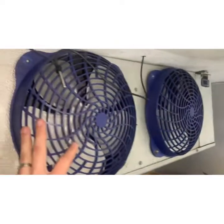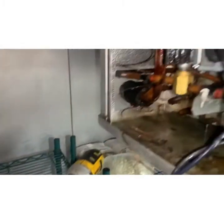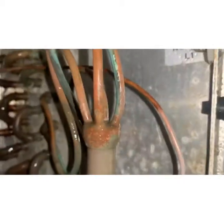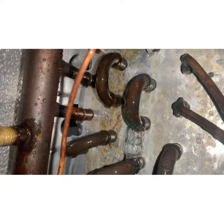Welcome back to the leaking cooler. So, spoiler alert. I took my leak detector and it was just going crazy in there. I couldn't pinpoint where it was. So, we've got the leak detector. And what you do is you spray it real stream like that. You don't want to create a spray, because if you spray it makes bubbles just when it makes contact. But as we kind of coat everything, look at there, and it lets you find your leak.